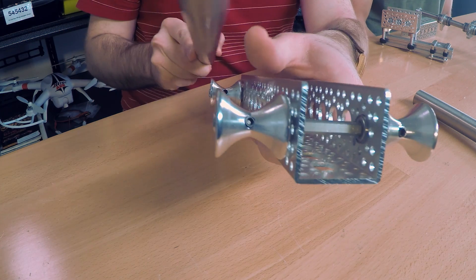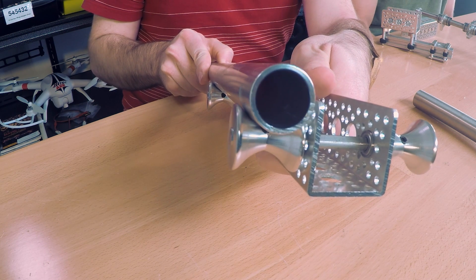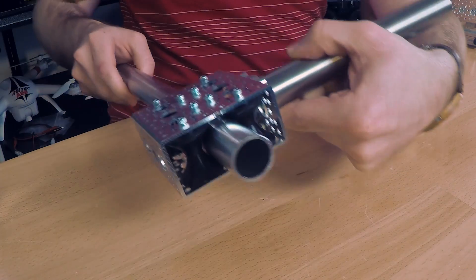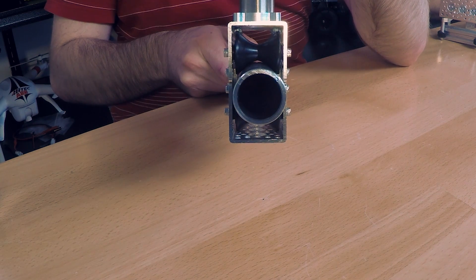The parabolic shape of the tube rollers allows you to run it on various different sizes of tubing, whether that's aluminum like we have here, or PVC pipe, or steel pipe, or even a garden hose if you want to do some different profile other than just a straight shot. The other nice thing about the tube rollers is if you mount them in the channel, you can run a one inch tube right through the middle, and as you can see there's almost no slop on that, so it holds the chassis very tightly and makes for a super low friction assembly.